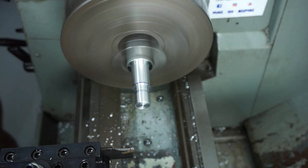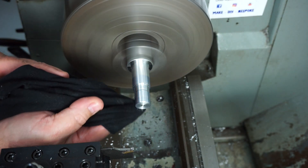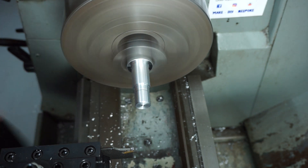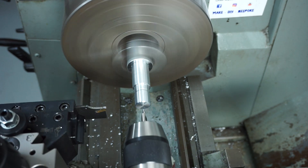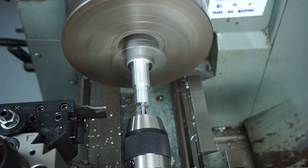Just giving it a lick with my old rope-shear lathe file to get rid of that blue mark. Be very careful using a rag around the lathe - you don't want to wrap it around your finger and pull your finger off. Popping in with a little Sutton centre drill just to pick up on the centre.